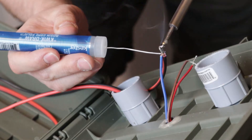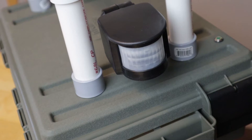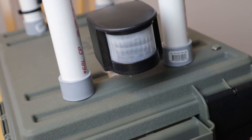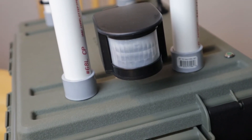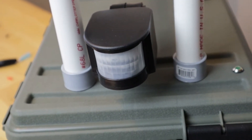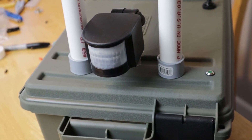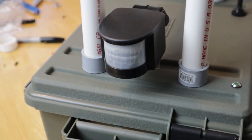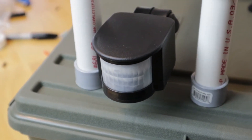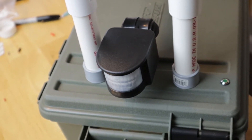Next was the motion control switch. I first tried a motion sensor switch that would ordinarily be used for an exterior floodlight, but after attaching it to the box and wiring it up, I learned that my switch was bad. I was pretty annoyed, considering I drilled a big hole in the box just for this thing. While shopping for a new one, I learned something that made me not want to use this type of switch anyway: while you can set the delay — how long the switch stays on after activating — the shortest setting was 4 minutes. I definitely want something much shorter than that. I want my contraption to run for seconds at a time, not minutes, so I looked for other options.